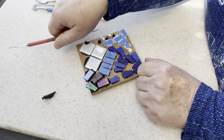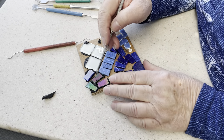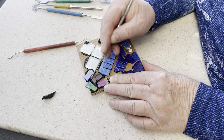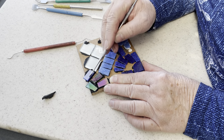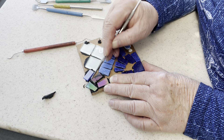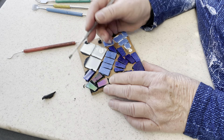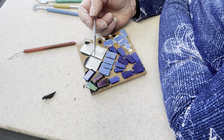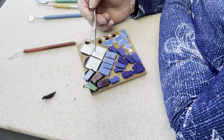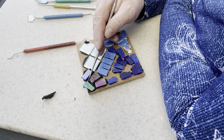You can see there's heaps of room now for the grout, although it's a bit wide. This little tool here, if you need to do a little scrapey cleanup, is fantastic because it just fits straight in there and you can give it a nice little rub to get rid of anything. If you get too carried away and remove some of the wood with it, you may find you need to reseal the wood — I did that once with marine flex. I had to lift a tile I wasn't happy about, it took the layer of ply off as well, so I had to reseal it and then re-glue. But you can see this is a really nice clean space.